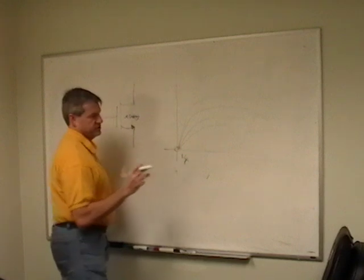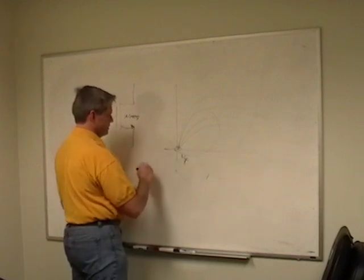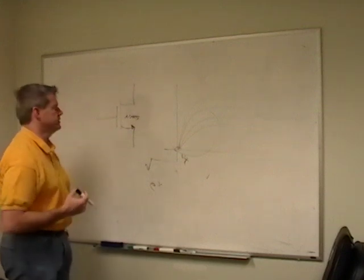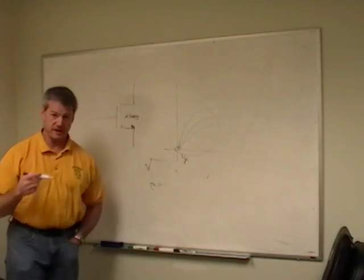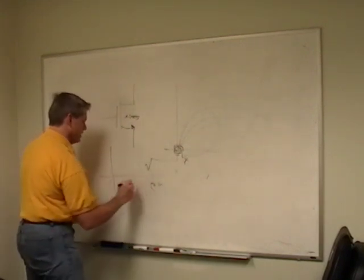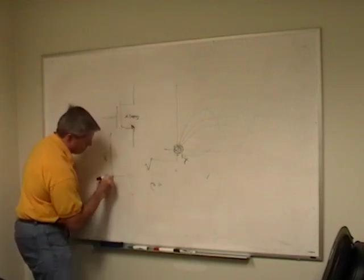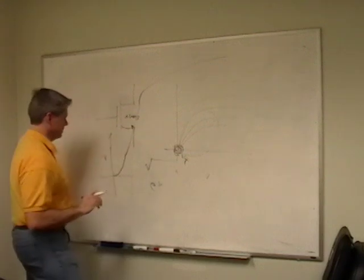And so I'm getting into MOS and CMOS now. One of the interesting things, though, you look at this, and if you look at this function for a MOS transistor, it's a square root rather than an e to the x power. So doing the right things, you can maybe calculate a square root with this. But gee, wouldn't it be nice in this technology if there was an exponential? And there is. It's just that it's way down here. If we zoom in on this area right here and go way down and say VT is here, actually I guess VT would be here, what we see is this has an exponential function here, and then it goes into its linear mode, and then it goes into its saturation mode. So let's talk about these things for a second.